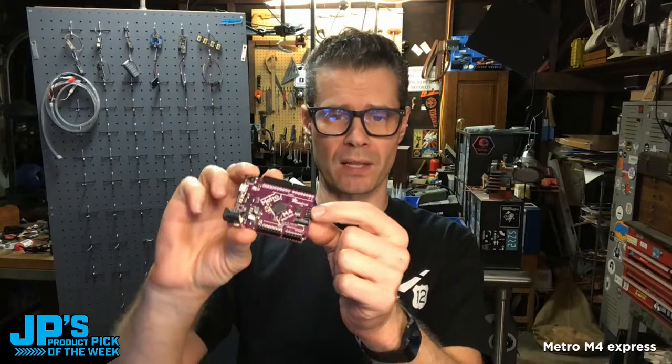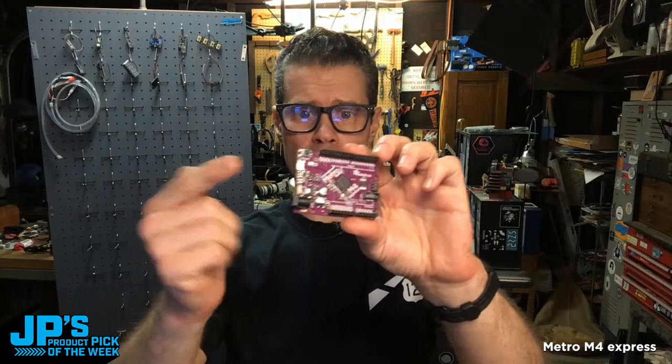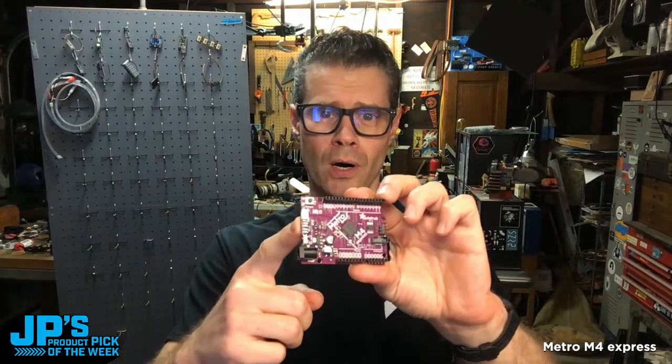Just like Lady Ada mentioned, we have two DACs so you can do stereo out. We have eight analog ins, a ton of GPIO, PWM all over the place, I2C, SPI. We have that little SPI pin there that some shields plug right into for direct SPI without any extra wiring. It can be controlled over USB for coding and for power, or you can power it just over that barrel connector — center positive, between 7 and 9 volts usually. You can run it off a 9-volt battery for a little while, or a AA battery pack, or a DC wall wart.